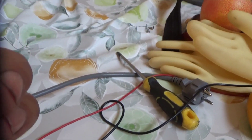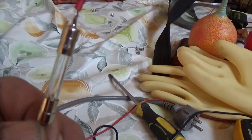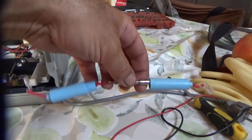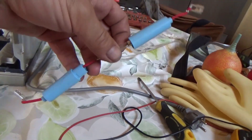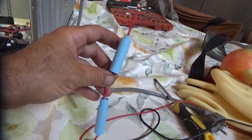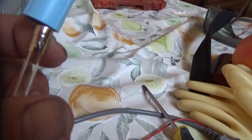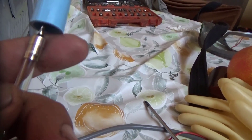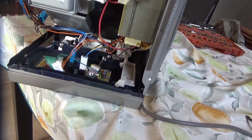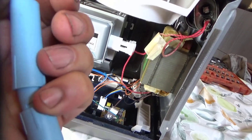This particular fuse is 5kV and 700mA. It's driving me a little crazy to get this fuse out because it can't be removed — it comes glued, soldered, whatever, and you have to order it complete. Depending on the supplier, it costs between 6 euros and 10 euros. I found one on Amazon for 10 euros that they deliver the next day; the ones that cost 6 euros take almost 10 days. I'll leave a link in the video description. This one is 5,000 volts or 5kV for 0.7 amps or 700mA. I'm going to order it from Amazon and when it arrives tomorrow, I'll finish the video on how to install it.